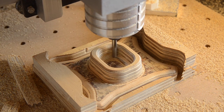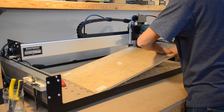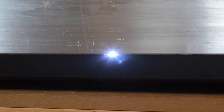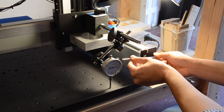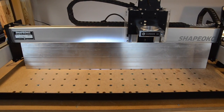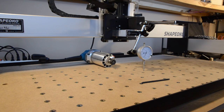In addition to the inherent limitations of its manufacturing process, here are some of the places where you could go wrong. 1. Metal bending is a relatively imprecise manufacturing process. When you fold metal, you put all sorts of strain into your part, and that can manifest itself in odd distortions. Plus, variations in material composition cause differing levels of spring back, resulting in non-perpendicular bends. In my machine, I noticed that my base plates were causing my wasteboard to dip in the middle, only by a few thousandths of an inch, but it's enough to cause noticeable variations in cuts if you're machining right at the edges of your material bounds.